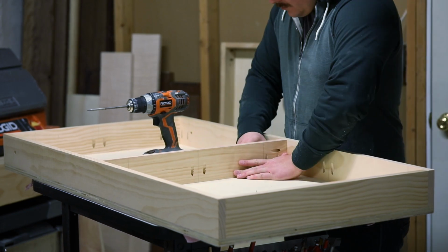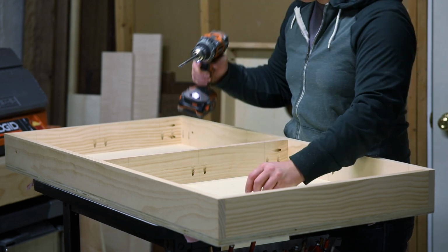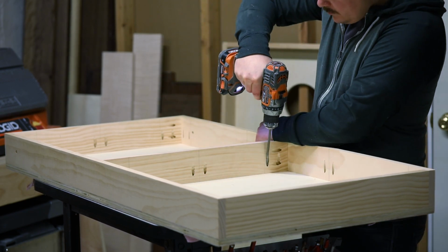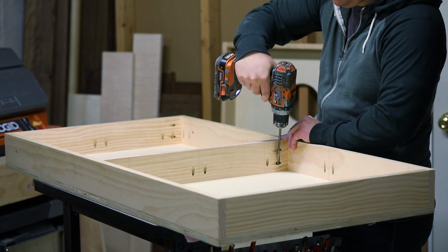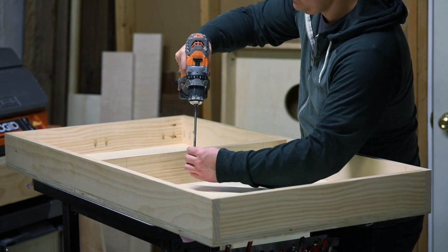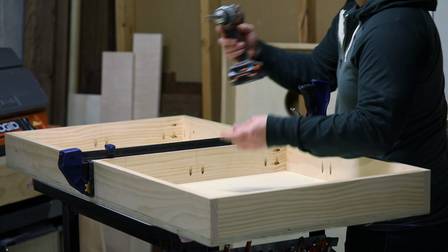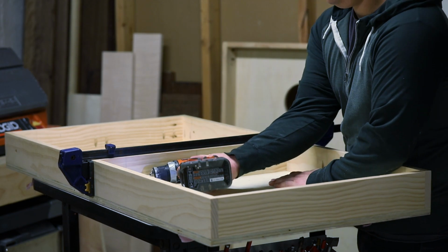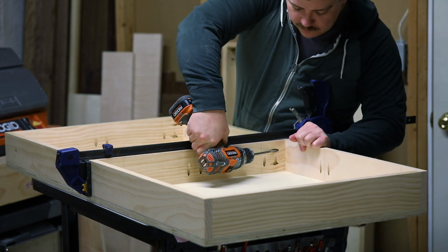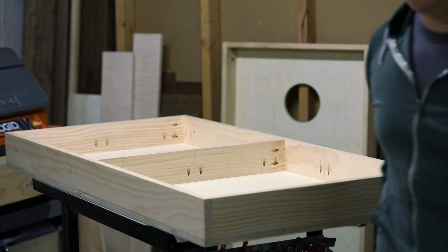If you read my description, you'll know that you had options when it came to the thickness of the top. 3/4 inch or 1/2 inch, either works. Make sure to note that if you did choose 1/2 inch plywood for the top, you're going to want to install a center support on your boards as part of the frame. Otherwise, you'll get too much bounce and the Cornhole Commission will shut you down. For the sake of demonstration, and to build a super sturdy set of boards, I did use 3/4 inch plywood, and I still installed a center support even though I didn't have to.